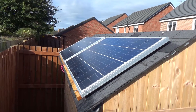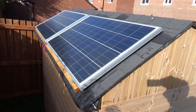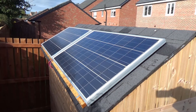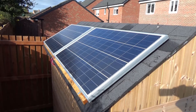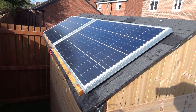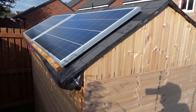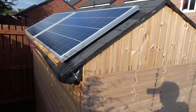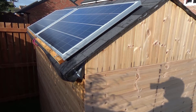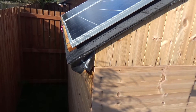Short update video - I've swapped the panels out and fitted two identical panels that I managed to pick up pretty cheap at £45 each, which for 100 watt panels is not bad. Unfortunately they were slightly different dimensions, so I've had to move the mounts back a bit - basically a wooden batten at the top and bottom. I've kept the top one the same and just moved the bottom one down and it's worked out okay.